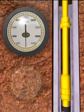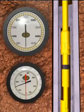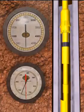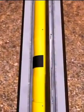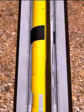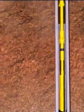Now that our cement is in place, we are ready to set the liner top packer. To do this we will pick up the drill pipe, expose the spring loaded dogs in the packer setting dog sub, and apply set down weight of the drill pipe. When sufficient weight has been applied to shear the setting pins in the packer, compression will energize the seal element and engage the hold down slips into the casing wall. The packer is now set and will provide an effective annular seal between our liner and the previous casing string.